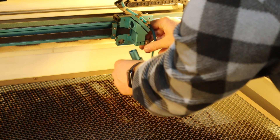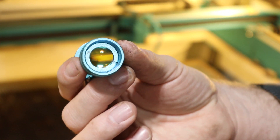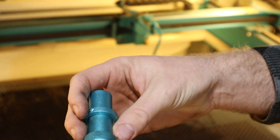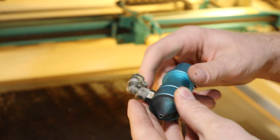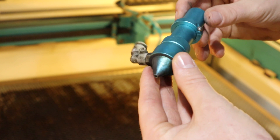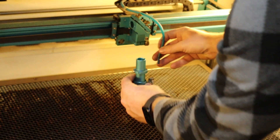The last thing I'm going to be a little picky about is the quality of the actual lens that came inside the machine. I didn't clean it for the longest time. When I first cleaned it, it was pretty dirty — I had just laser engraved some rubber hockey pucks and this got way fogged up. I took out the cleaner and utilized it, and before I knew it my entire laser lens was ruined. It had some sort of film on it that started peeling off and it was useless — I had to order a new lens. I'd expect the best laser lens to come with the machine, but I learned there are other brands produced differently that do better. It was only a $20 replacement lens, so I keep one on hand now — no big deal.